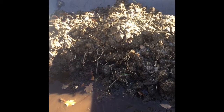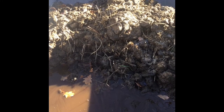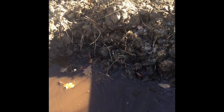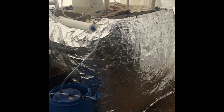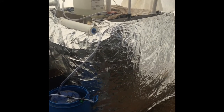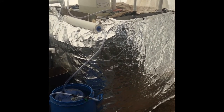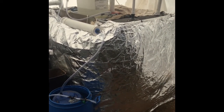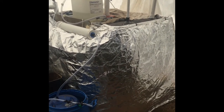Sorry if you guys are around eating time, but this is what you have to deal with — a lot of crap. Especially fresh crap to make it into a stomach; that's how you start biodigesters. What I did is I had a lot of cow manure that I made into a slurry and fed it through the top lid. With the water and the manure added, the tank sits and an acid process begins, breaks down all the manure, and then the bacteria in the cow poo starts to eat that acid and generate CO2 to begin with, which has to be flushed out of the system.